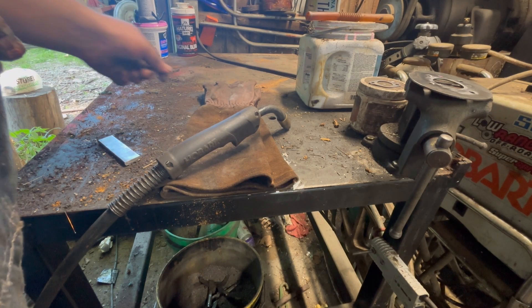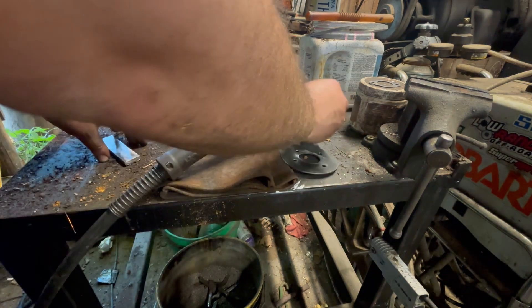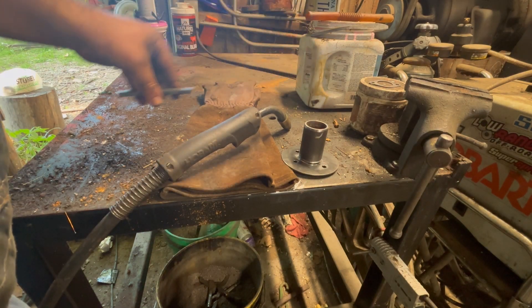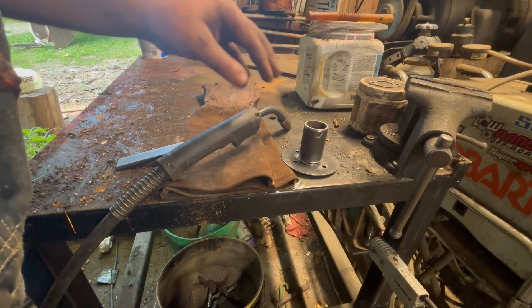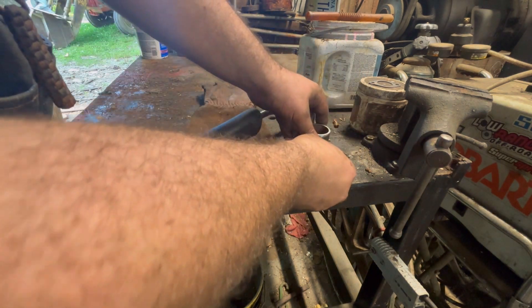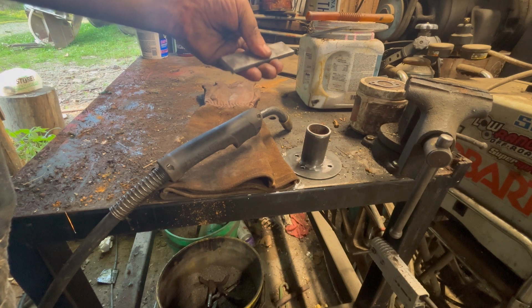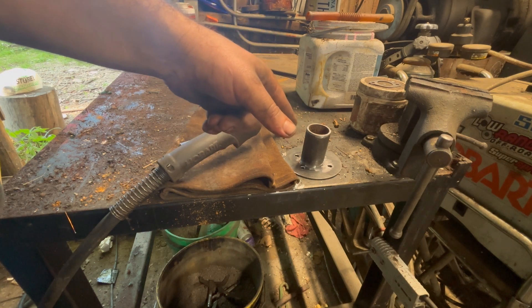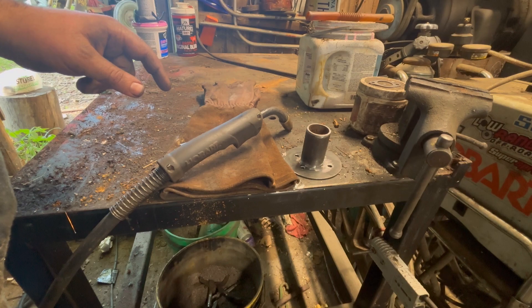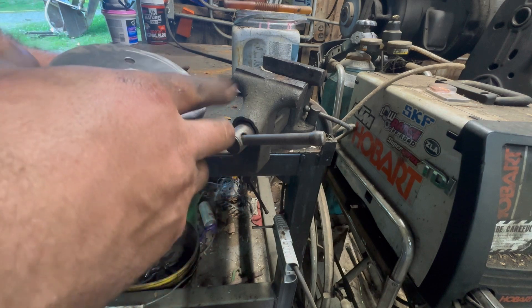As I might have mentioned, I'm going to be needing an adapter. So I've got this plate that's made to that same bolt pattern that's on the flywheel, and this tube that's nicely squared off on the lathe — all clean, everything's cleared up, ready for welding. And then this plate, I'm going to weld that on and I'm not going to drill and tap that until I've got it on there and welded and squared up, in case it moves while it's cooling. I'm going to bore all this out a little bit — there's just a little bit of protrusion off the engine to help pilot that. The only mechanism for lining that up is those two bolt holes, so those have to be perfect. I changed the design just a little bit — put a little step in there so that it fits real good and tight on there to help locate it.